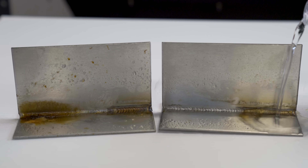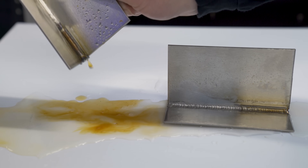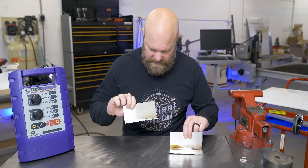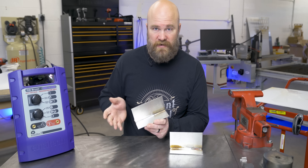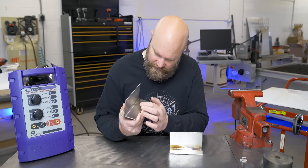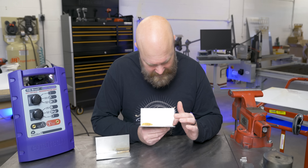I'm going to rinse it off with some water because any rust is probably light surface rust. There you go - turns out they're not crazy and there is a reason for it. A couple of things that surprised me. Seems like in the uncleaned weld, it started getting some corrosion in the actual heat affected zone and then some spots right on top of the weld. Obviously this is stainless and I only had it sprayed and soaked for probably not even 10 minutes, but it already started corroding in the heat affected zone and a tiny bit on top of the weld.